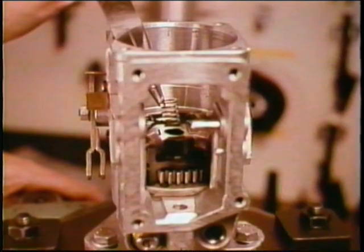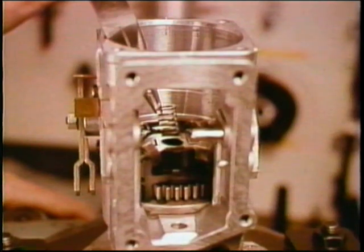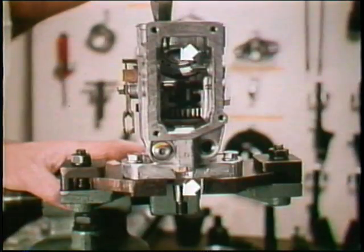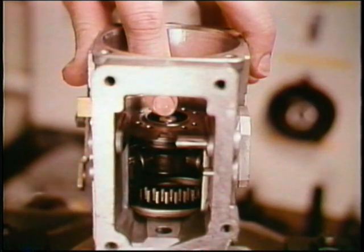Now install the drive disc into the roller cage and lower the spring into the drive disc recess. Then put in the cam plate so that the plunger drive pin aligns with the drive shaft keyway. Put in the pre-stroke spacer, which you took out in disassembly.